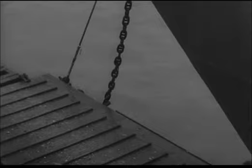He also makes sure that the ramp is at an angle between 18 and 24 degrees to the deck, with the hinge pins flush with the water. The position of the ramp is of the highest importance for safe launching, and it is the responsibility of the launching officer. The readiness of the craft for launching the tanks is the responsibility of the senior naval officer, who can stop the launching if at any time he considers his craft is being endangered.